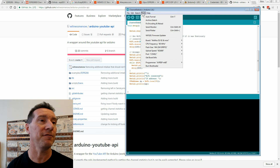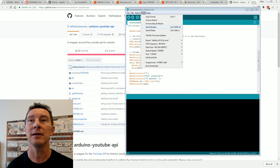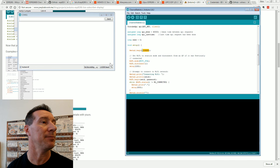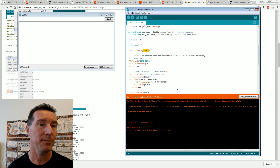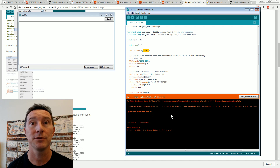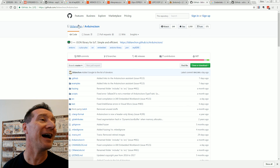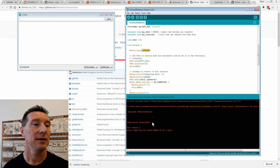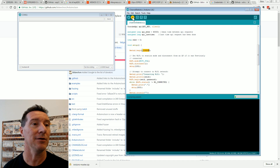Let's give this a go. First, open the serial monitor — COM11 at 115K baud, we need to select that. Let's actually download this — I've put in my credentials, API key, YouTube channel ID, and Wi-Fi password. Error compiling — Arduino JSON missing. So we go to the Arduino JSON GitHub. We'll download that and install it just like the previous library — add ZIP library, JSON master — library added. Now we should be able to compile again.